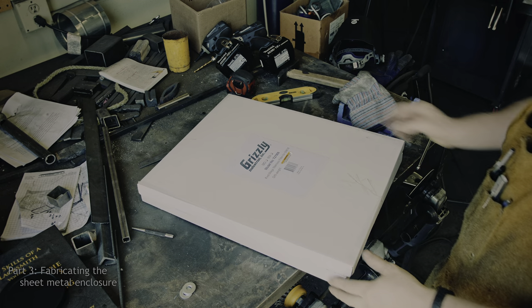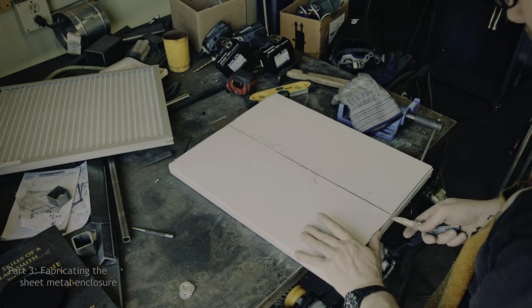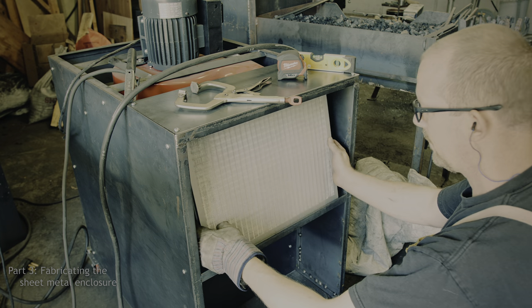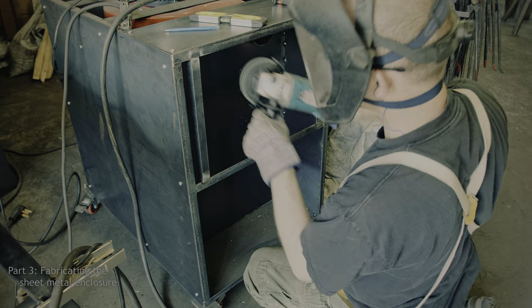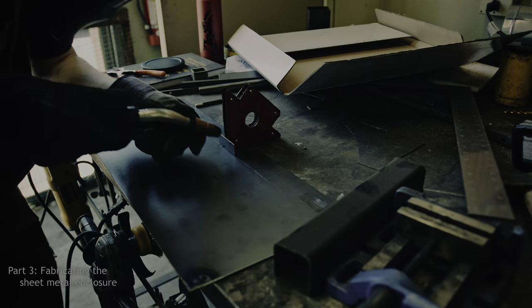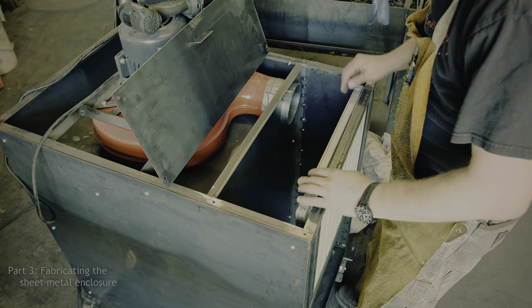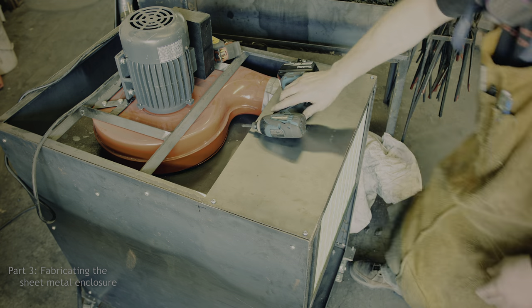In addition to the mechanical separation of dust, I also plan to install two stages of filtering to the exhaust air. The first filter stage filters out particles larger than 5 micron, and the final filter stage steps it down to 1 micron. This whole project is not designed and rather follows the slap-it-together philosophy of construction. Here, I am creating the box that will hold the filters. Angle iron that gets welded into place works quite well for that. The main challenge will be the mechanism for holding the filters in place while also allowing simple replacement of filters as needed. My solution to keeping the filters in place is to weld a tab on the top cover that presses the filters together at the top — simple but effective. Checking by hand seems to indicate that they will stay firmly in place without any movement between the filter stages.